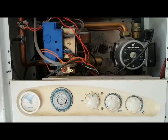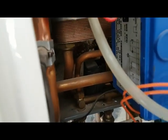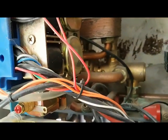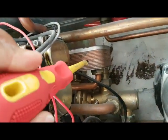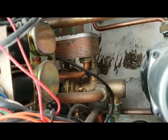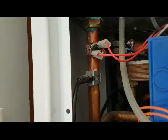When we run the hot water tap, water flows through into the water section of the diverter valve. That's the micro switch at the end of the diverter valve — it moves and makes up the micro switch. At the same time it shuts off the port going to the heating return, so the primary water from the main heat exchanger sends its heat into the hot water heat exchanger to heat the hot water. Cold water comes into the plate heat exchanger and is heated by the transfer of heat from the primary water.